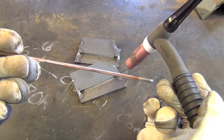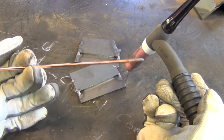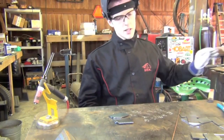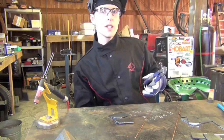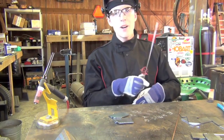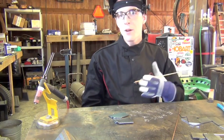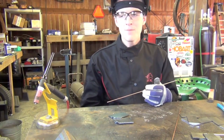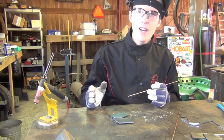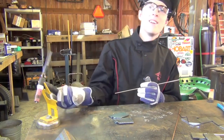For this series I recommend the use of filler rod because one of the main things I'm trying to help you work on is your ability to feed filler rod — so get as much practice as you can. I'll slice another filler rod in half. Basically, what I'm going to do is work my way down the joint and while welding, try to have the puddle just barely envelop the top edge of the top plate.